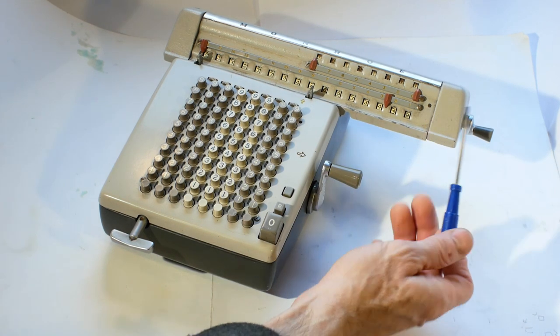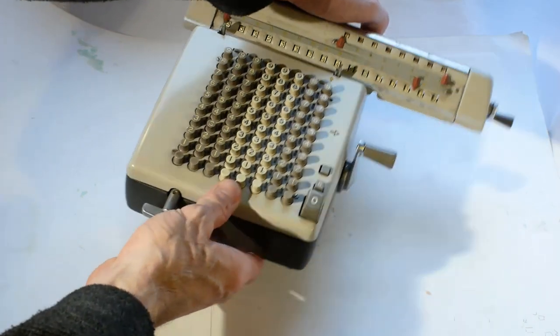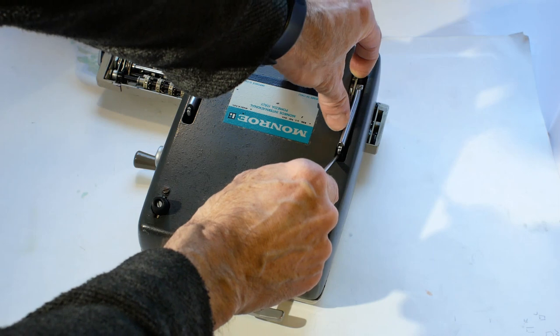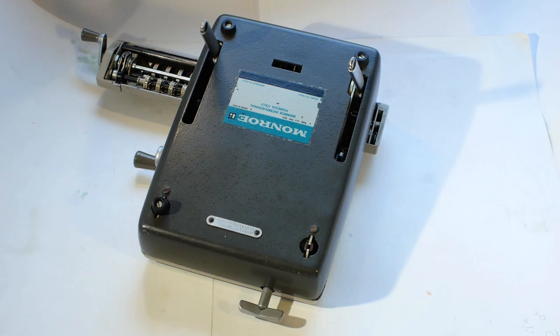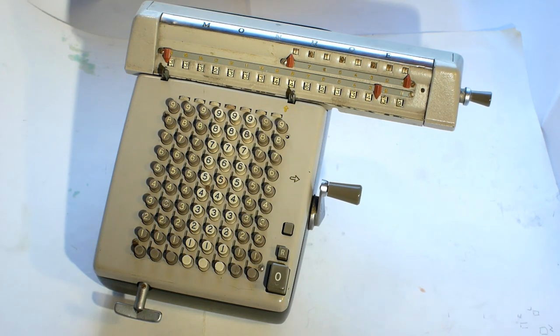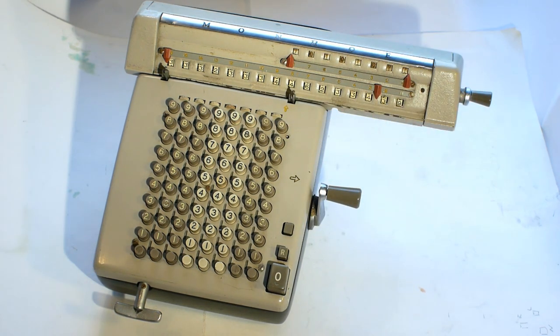There should be a handle on the carriage here for lifting it and that's been broken off, and there's also a screw missing on the case. If I flip it over to the underside, there's a foot missing at the front and the rear feet are meant to pop up when you press this lever, but at the moment they're stuck down because the right hand one is bent. Also there should be rubber feet on these rear feet, so that's another thing to fix. Moving back to the front, the carriage shift lever is working fine, but the carriage reset is jammed and the main mechanism is jammed. If you ever find one of these that seems tight or jammed, don't try and force it because that's the best way to break them.